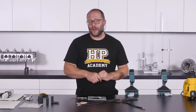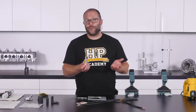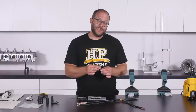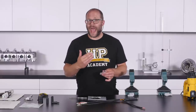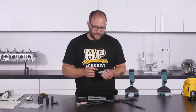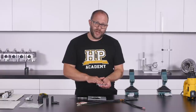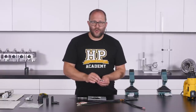You have quite a lot of working time. The syringe is a completely standard syringe available from any electronics supplier, and the tip has a one millimetre bore. That's a really good size to squeeze enough epoxy sealing compound out easily while also getting into those tight spots in our transition point. Using the pick, get the epoxy sealing compound into the back of the syringe and squeeze it down to the tip.